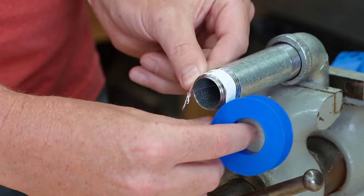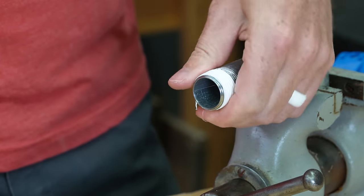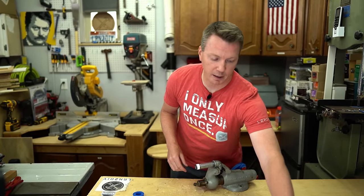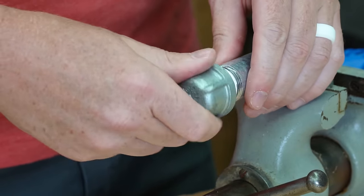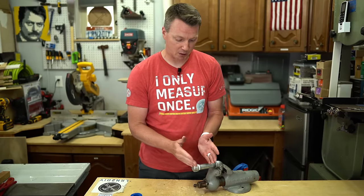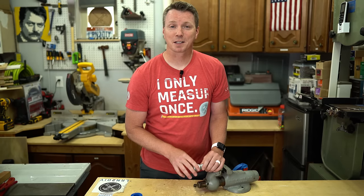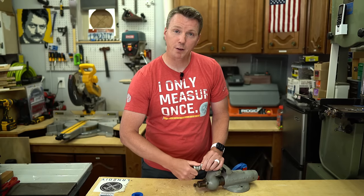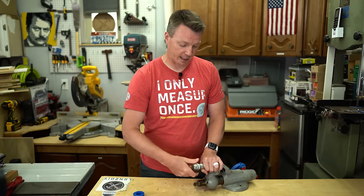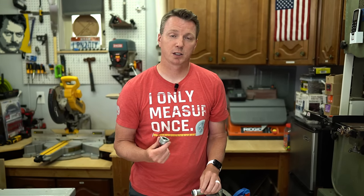I'm going to wrap this around once, twice, three times, four, five, six. Got a great seal on there — I can still see the individual threads; it's not blanket-wrapping them. When you go to put a cap or another fitting on, it's still got plenty of room. The tape is sometimes misunderstood — yes, it is a sealant that can fill in any gaps between the threads, but it's also a lubricant. That means it makes it easier to fit the opposite fitting on even further than without tape, keeps it from getting stuck, and makes it easier to slide off after the fact. It's a dual-purpose sealant and lubricant, really perfect for plumbing in general.